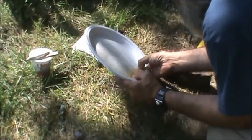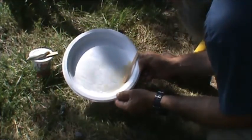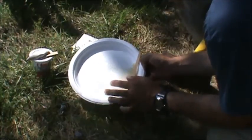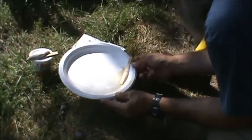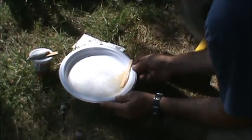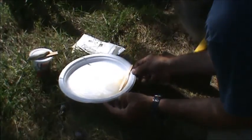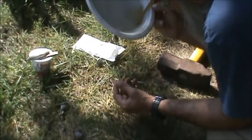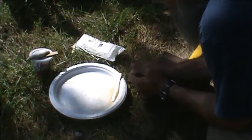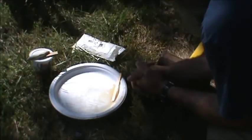Like I said, it's still a little soft, but the way it's stuck on there, and all of it is thoroughly dry. A lot of times when you mix epoxy, you get spots that are greasy, and those are spots that didn't get mixed. Now, like I said, I spent at least 2 minutes mixing this back and forth. It was kind of a milky color when I got done, but it's cleared up now. So I guess in a few days I'll go attack something with this. I don't see where this is going to be a problem.